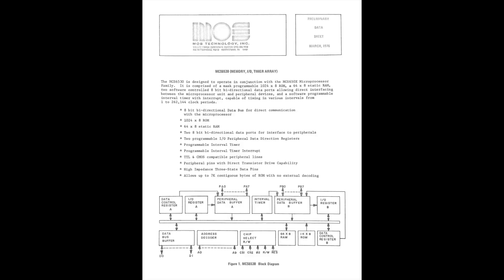With that short history lesson out of the way, now we're gonna get to the fun part: the technical details about how I dumped the ROM image from this chip. I know what you're thinking - dumping a ROM image, you just buy a TL866 off eBay for $11.98 and press the button. That's the case with most EPROMs and mask ROMs, but the 6530 is a little bit more complicated. Here's the data sheet for the 6530. I've highlighted everything that will show up in the address space of the chip when you read it. You have to navigate more than just a ROM, so our first challenge is separating the ROM image from the rest of the stuff on the chip.